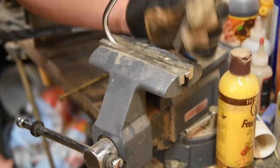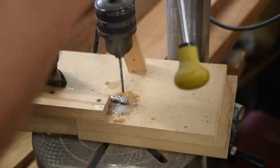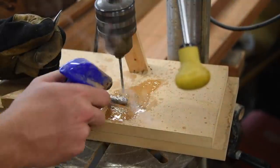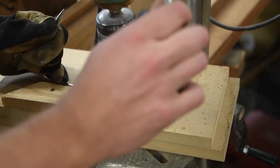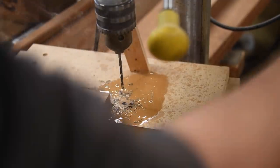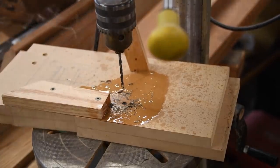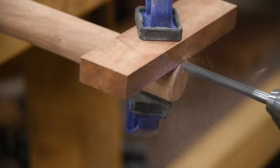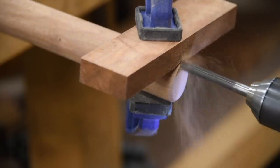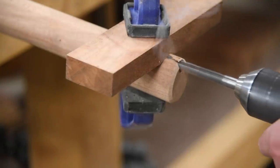Make a little punch for the drill bit to register. Ideally when you're drilling steel you want to be down around 900 RPM — that was a little too fast. I tried something new here: I carved a bit of a groove in here so it kind of matches the profile of the handle, and then I'm clamping that on there to help guide this drill bit, which is 3/8 inch in diameter.